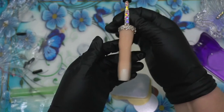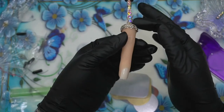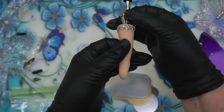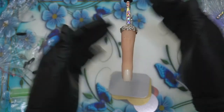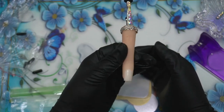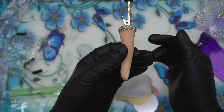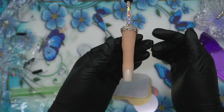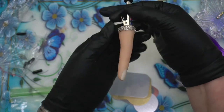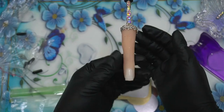So let me show you this. It's snug and secure — it's not going to come off. You can tug on that finger pretty good. You can kind of turn the finger a little bit, but if you keep turning the finger itself, you might stress that hole and make it bigger, and then it's just useless. So you just twist it once in the opposite direction to loosen it, and then you can move the finger from side to side. It's not coming off because you had to unscrew that thing several turns to get it off. So this protects that hole — it's not going to loosen up because you're not having to take the finger on and off. Then if you're putting forms on this finger, you just tighten it back up — you just have to turn it once. And then you can use both of your hands to put the form on and not worry about it moving around.